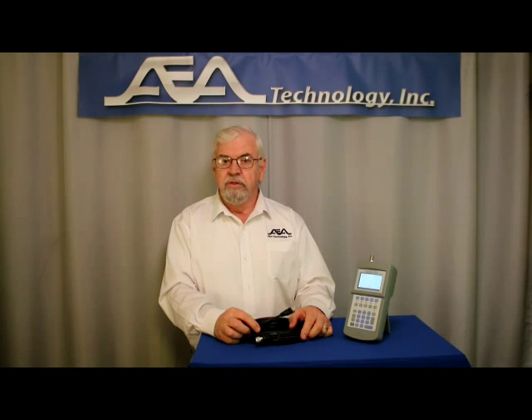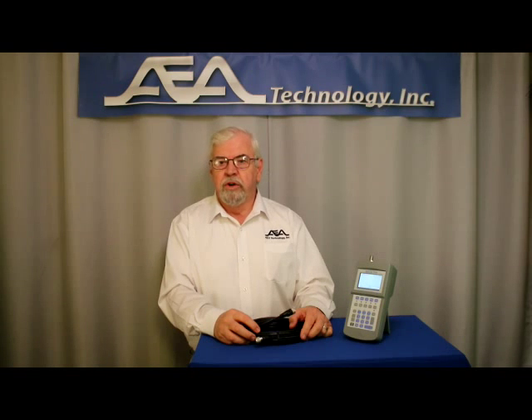The TDRs have an impedance range from 0 to 1000 ohms. They can test cables with an impedance from 40 to 120 ohms and remain within their accurate specifications. The TDRs can test any type of coax, from the tiniest coaxes used in medical probes to huge diameter broadcast tower feed lines. We'll be testing some 50 and 75 ohm coax cables, covering the physical structure and common faults that govern the reflections shown in the traces.